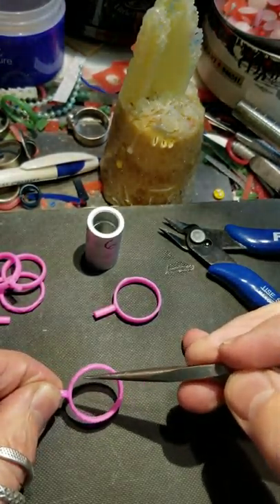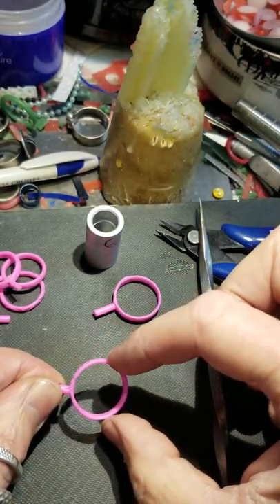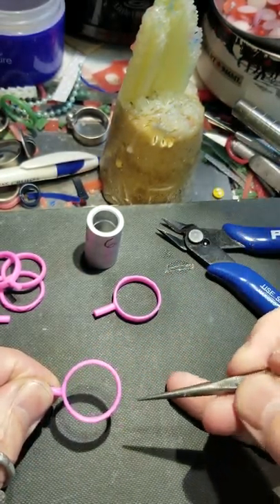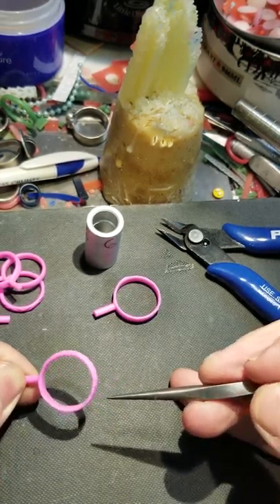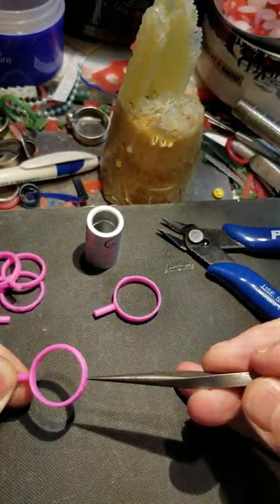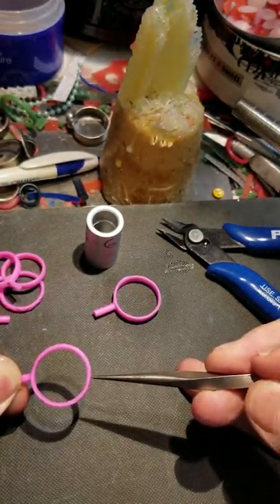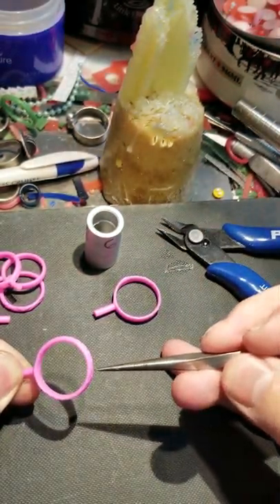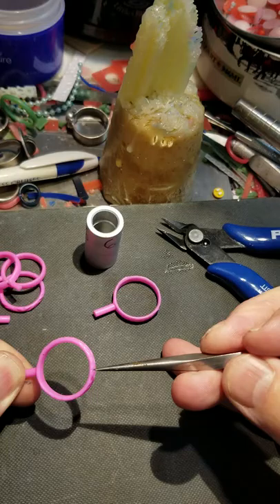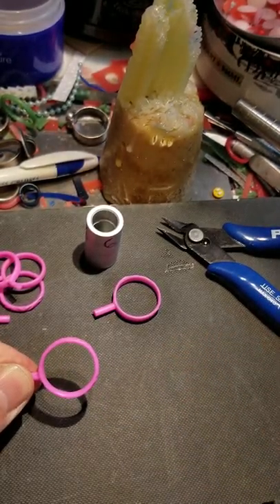The other thing I check right away is where the two sides of the wax come down the gate, flow around the ring in the mold. This part up here on the very end can sometimes have a little spot. I chose this one because there's a little spot right there where the two sides came together and it didn't completely shoot. That's not a big deal as long as I spot it — I just touch a little bit of wax to it, so this is not a reject. You just have to decide how much work you want to do.